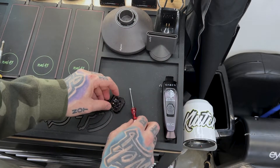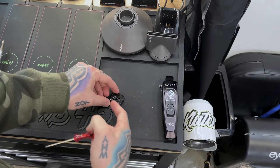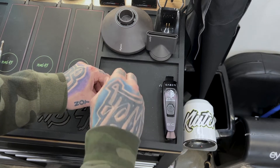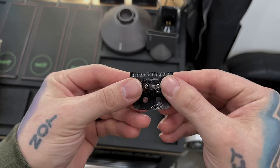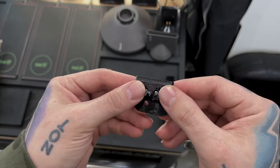I can kind of twist it and go left and right. All we're going to do is press it all the way towards the blade setter — this lip right here keeps the blade from going too far. We're just going to press it towards that lip. I've got my middle finger in the back holding it still, and I have my other two fingers holding the blade where I want it. Then I'll just come in and snug these two screws down, slide it out of here, and we can check it out. After you get it set, you want to look close — you can see that is like absolutely zero gap.